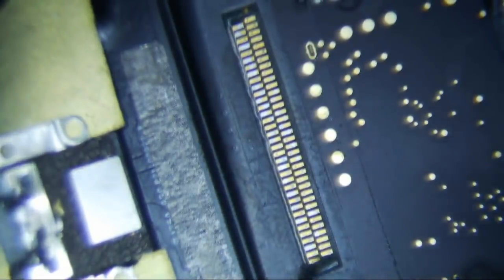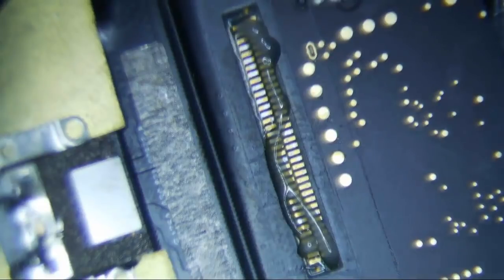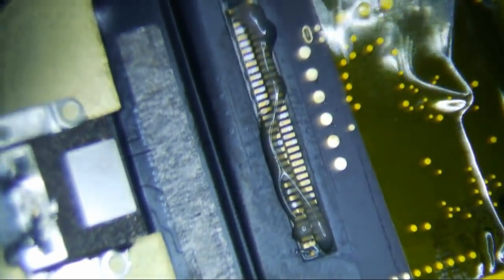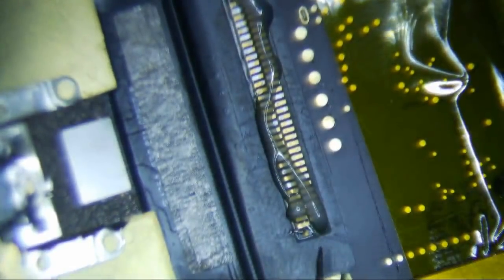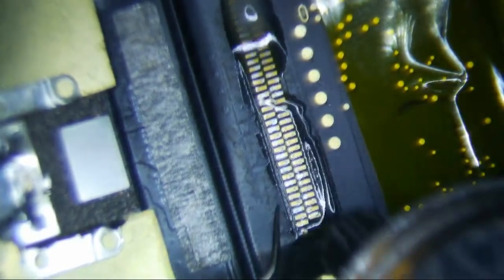Not a whole lot to this really. I just put a little flux on it and will blast the hell out of it. 416 degrees Celsius and air flow of 17. I'm just going to tape this down so I can kind of lift it a little bit. I like to use hot air and then just grab a corner and melt away until it's good to go.